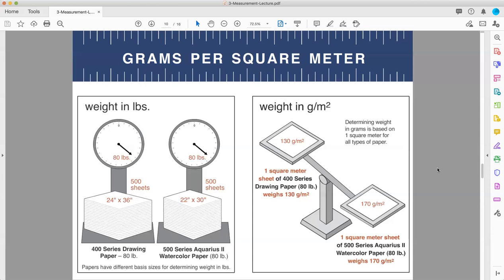So in order to keep the toner ink sticking to the paper and also not burning the paper, they had to have a system of defining how thick the paper was. And since people don't always caliper these things, the best response was to use the international system, grams per square meter, because that's directly comparable. And that is why GSM is something in the United States, because we needed it for digital printing.